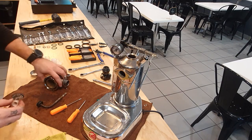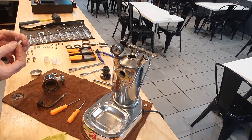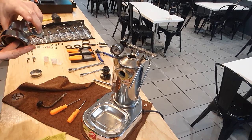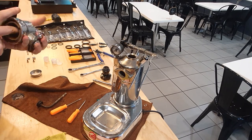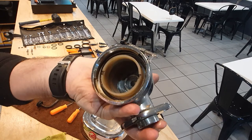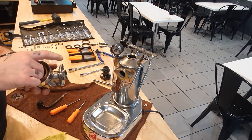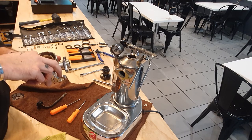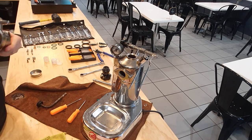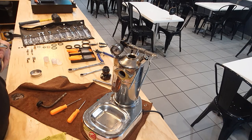What we are going to do now is that clear seal — lubricate it and pop that guy in. The brass guy may take a little bit of force. It doesn't necessarily locate in there but you just want to make sure you get it below where the circlip has to go, so I'll give it a little bit to make sure it's easier later.